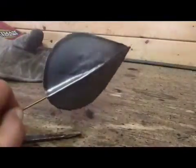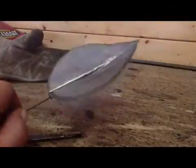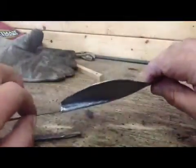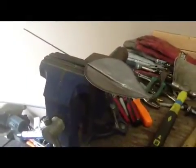There's our leaf so far — we hammered it and opened it back up. As you can see, it's already starting to cup and get distorted, which is why I like pinching it a little bit — it really gives it a natural shape. So at this point I'm going to put it back in the vise and weld right down the middle, which also attaches the rod to the leaf, and then we'll put our veins on. One thing I like about working in the vise is you can just clamp your ground clamp for the welder right onto the vise, and anything you put in the vise will now be grounded. When you're working with small things, that clamp sometimes is a real pain in the neck, so it's useful — and it's also helpful to have a decent vise.